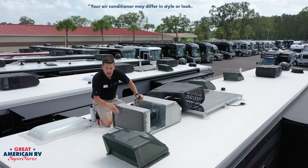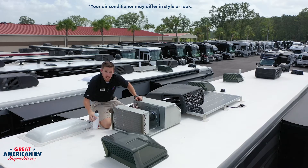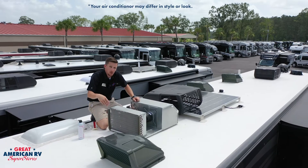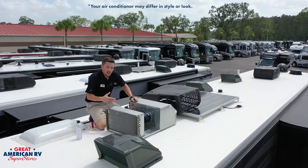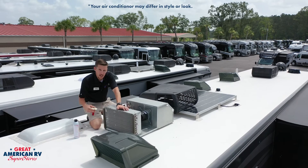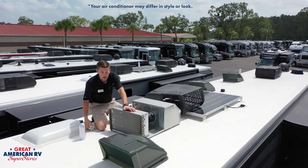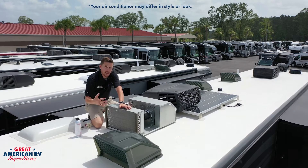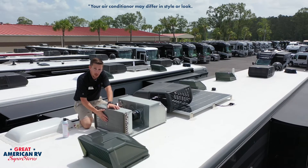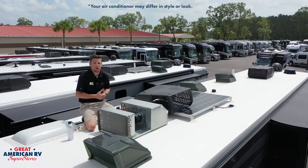Once you're up here and have access, get some AC condenser coil cleaner, shake it up real good, and spray it onto these coils — probably twice if they're really dirty — and allow all that stuff to come down. You can hit it with a light spray from a water hose; don't hit it with a jet because that'll damage these coils. If any fins are damaged, you can get a fin tool at any local hardware store and straighten those fins out. This is important because this is where air circulates to cool the unit inside. If these fins are blocked or clogged with dirt and debris, your AC isn't going to function like it should.